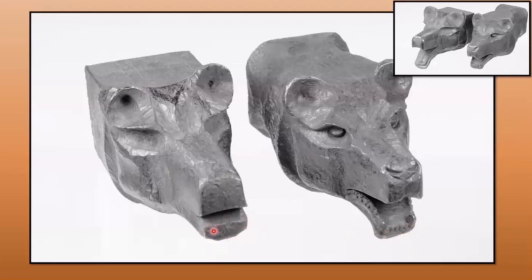You've got to be careful when you cut. You can see here that my cut actually has a slight arc to it. I get that by raising or lowering the curved chisel that I use. The curved chisel has a chamfer on it, and so I'm going to park either the lower chamfer or the upper chamfer into the material to try and dictate how this cuts. And then if you look at this top right photograph, again, we're going to split this lower section in half and start to create the lower gums and the upper teeth. So don't feel like you're taking too much. Split this in thirds, leave two thirds, take the bottom third and we'll go to work.